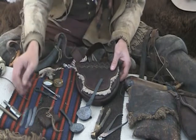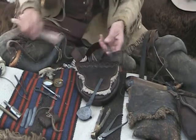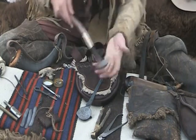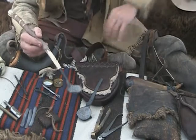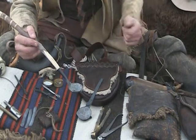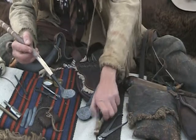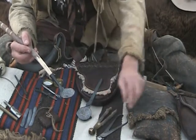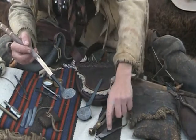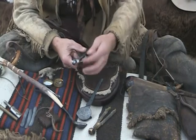I usually have four or five lead bars floating around the bottom of the pouch. When it comes time to make the balls, you just need to find some kind of stick. My friend whittled this small ladle — it's small because I don't want to carry a great big lead ladle in my shooting bag. I can melt enough lead to cast about eight to ten balls. Here are a couple of ball molds: this one from a company called Rapine, which is a steel mold, very solid. You want to carry a ball inside to keep the jaws together.